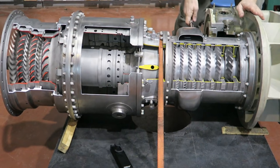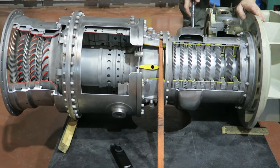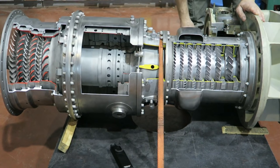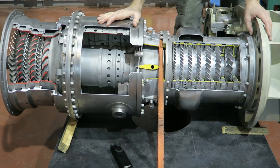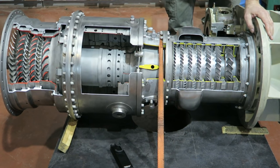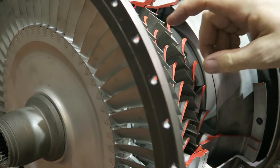Let's turn this — it spins at 23,000 RPM, and I've got a ratchet here. For industrial use, you'd want to be able to decouple the load from the output shaft when starting, because the engine probably starts around 5,000 to 6,000 RPM and you have to spin it to that speed before introducing fuel. It's much easier to spin it to that speed if the load isn't present. This particular engine was used for generating electricity — you just switch off the electrical output of the generator and spin it up. Yes, a hot-end drive engine.